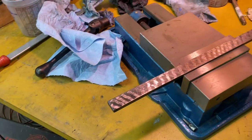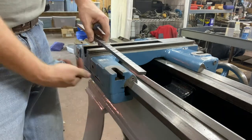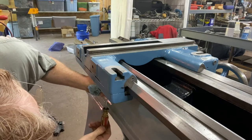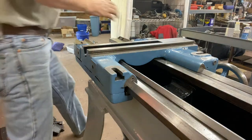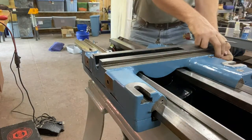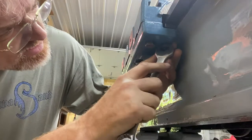That's what it looks like — kind of a cool pattern that should retain oil. On the gib on the back side there are these little holes and those four screws underneath, and I can feel it catching on them as I go in, so I'm going in until it feels a little tight. Let's see how it moves — I can't feel any wiggle. I think that's good. I'm going to tighten up those jam nuts, 11/16th.